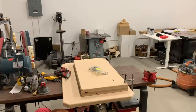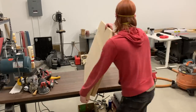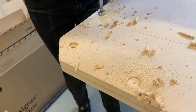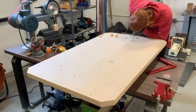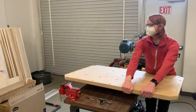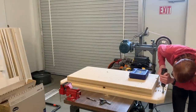Then I just clamped it down and put a couple of screws in from the bottom before flipping it over. The next day I removed all those screws, and then went around and put a bunch of counterbores in this for where there will be some T-nuts that will hold the pan down. Then I drilled a small pilot hole all the way through all the MDF where each of those counterbores are. Those pilot holes act as a guide from the bottom side to be able to drill a large counterbore for the head of the bolt.